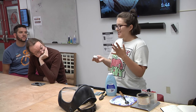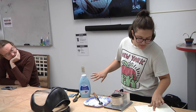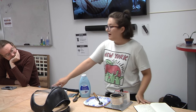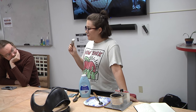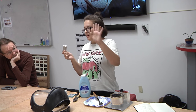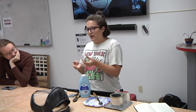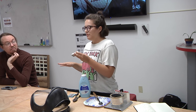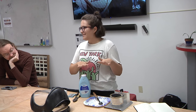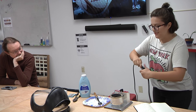We only ordered two pounds because we really didn't know what we were doing with it, but this is what we have left and it's what I'll be demonstrating with. One thing to note: it's super easy to find a lead-free version. When you're searching for this online, you want to look at the chemical breakdowns on the product page, because a lot of them do have lead. I wanted to be super careful with this so everything was safe. I do like to wear face protection when melting this, because if any water comes in contact with the molten metal, there's a chance of a chemical reaction and splashing.